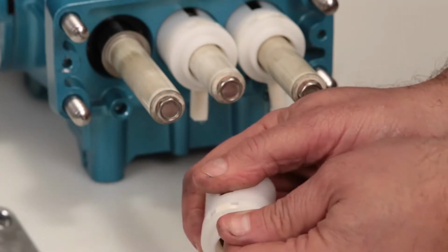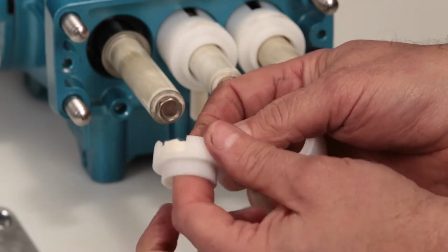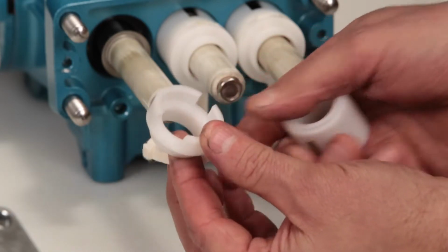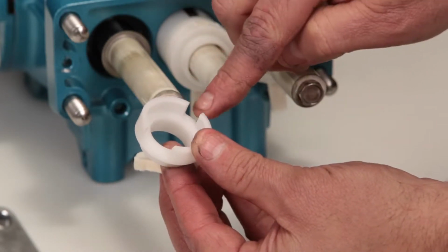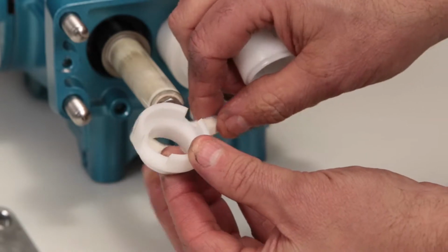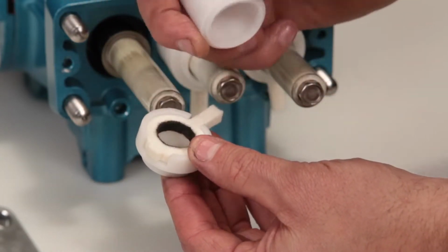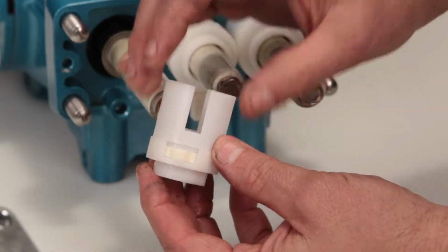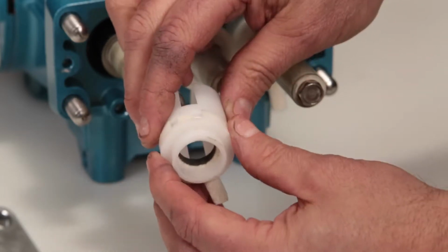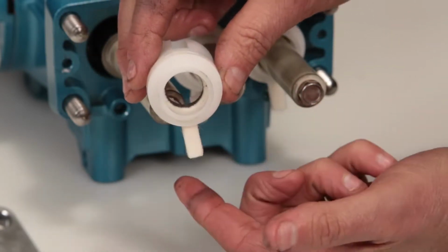If replacing the wick, the retainer can be pulled apart by hand. The retainer contains a small slot and large slot. The large slot should face the top of the crankcase to allow oil to fall onto the wick. The retainer can be snapped back together. Ensure the slots of the rear seal retainer are positioned vertically and the long tail of the wick is facing down.